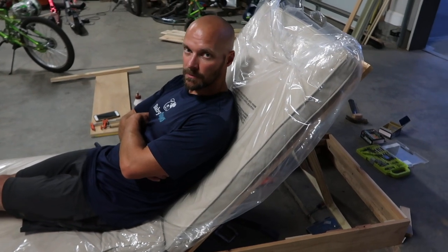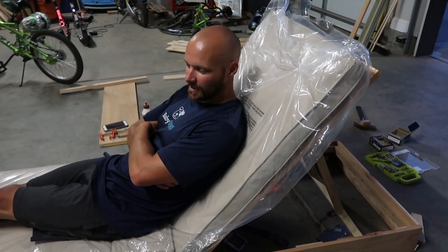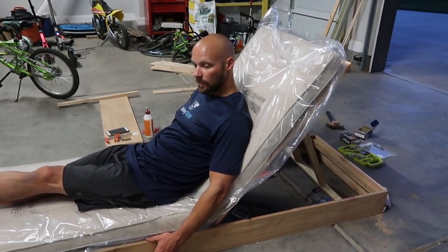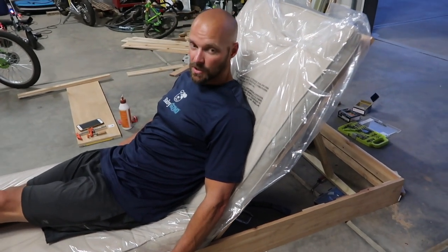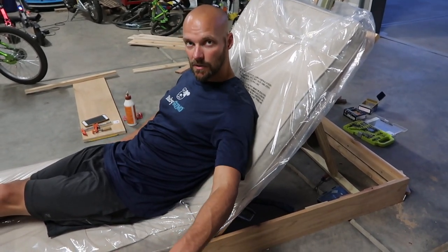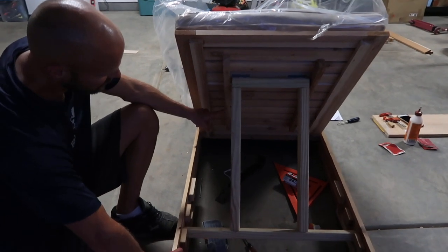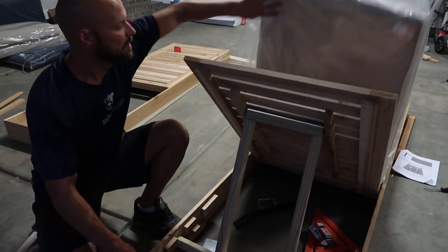It's dark out and we're tired, but we have one chair—minus the legs—put together. It's a legless chair but a very nice legless chair. It's not stained or filled yet, so there are still hours of work, but one is done. I think we figured out all the problems we ran into. The directions are really not good—the frame instructions were nice and the base section tells you what to do, but for the back section it doesn't tell you anything. We did some trial on the back and initially connected it too low, so when I sat on it, I pulled the whole board off.